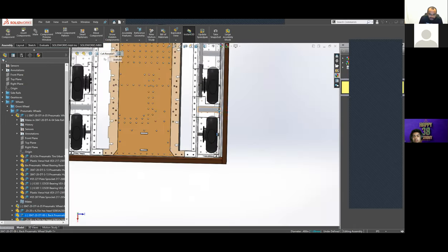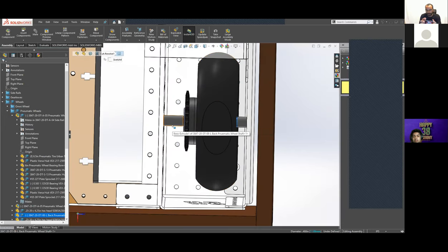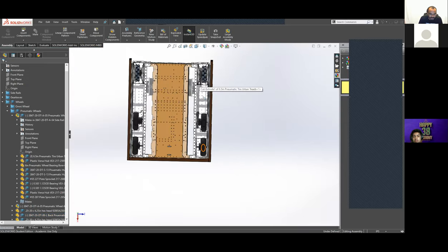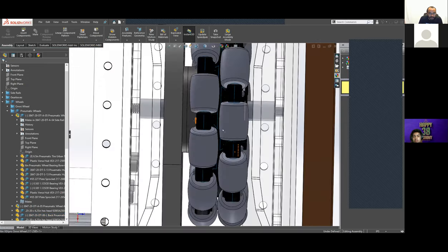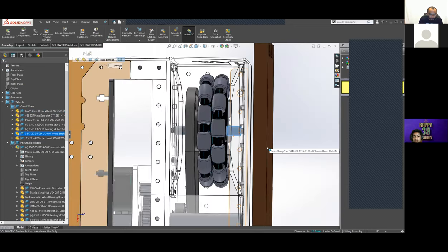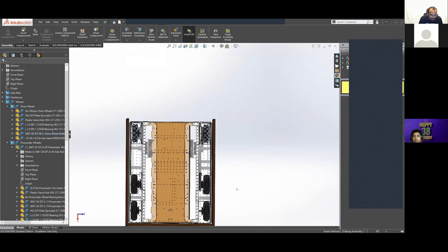That whole wheel assembly becomes its own module. So if we need to swap something, you pull the bolt, the whole thing drops out, and you're not worried about spacers or shaft collar locations or anything. Everything's perfectly located by the snap ring grooves lathed into the shaft, and you can get spare parts really easily. It was very helpful when we had to replace the Omnis a lot of times during Dripping Springs. We could have spares built ahead of time, and then coming back to the pit, we could just swap them with a single bolt pull, basically.